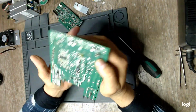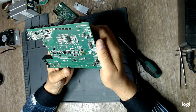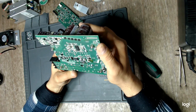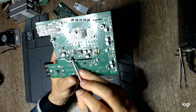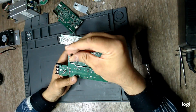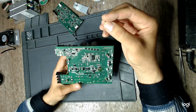As I said, this board is missing its gate driver IC. Tony removed it to test it on the other supply and could very well have other issues. Also, the snubbing capacitor is missing, but Tony sent me new caps, so I have replacement for that. The jumper.